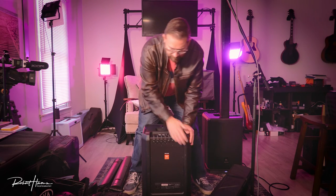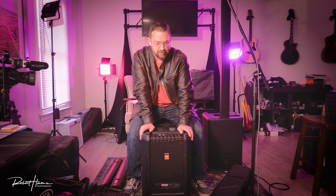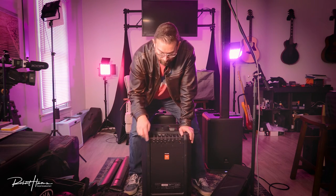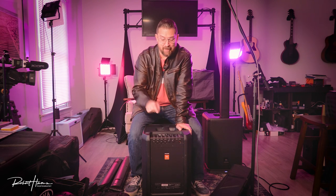On the input side of the PRX1, we have seven inputs instead of five. The seventh input, just like with the EON 1, is an auxiliary input — an eighth-inch or Bluetooth input, so you can stream to it, which is really nice. We've got four combo XLR jacks and then two high-Z inputs. It's also, just like the EON 1 Mark II, mic and line level switchable — it automatically detects and switches. When you're at line level you get 56 decibels of preamp gain you can apply to each individual channel. When you're at mic level, you get 100 decibels of gain that you can add. That's a pro audio feature — but then their little color coding lights for what the signal is actually doing are just ridiculously irritating, though not as much on the PRX1.